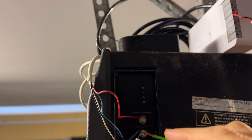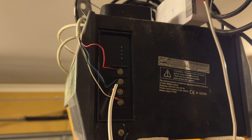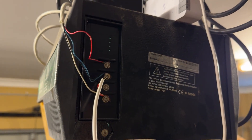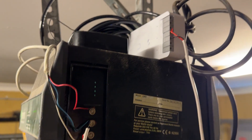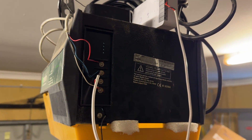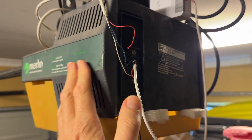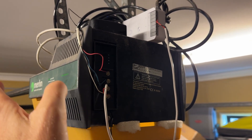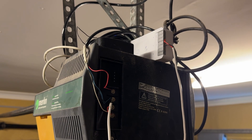If I actually complete between these two terminals, the door opener starts. If I do it again it stops. If I do it again it reverses its direction. That is all that we're going to get our UA Hub Mini to do — that function. We could also connect an exit switch to these terminals, maybe on the wall of your garage so that you didn't need to use the app, and you could use that to set the garage to open. All we're doing is relying on the functions of the existing opener and completing a dry circuit — the controller does everything it needs to do. It knows how long to run for and when to stop.